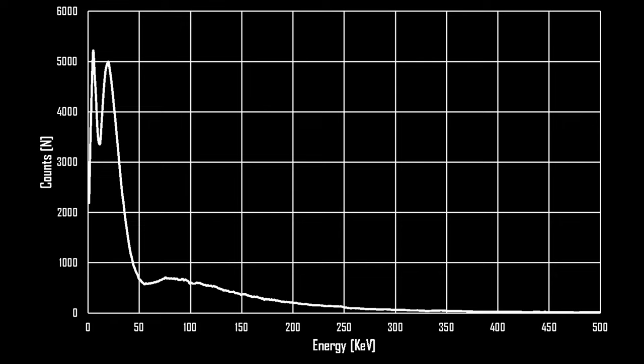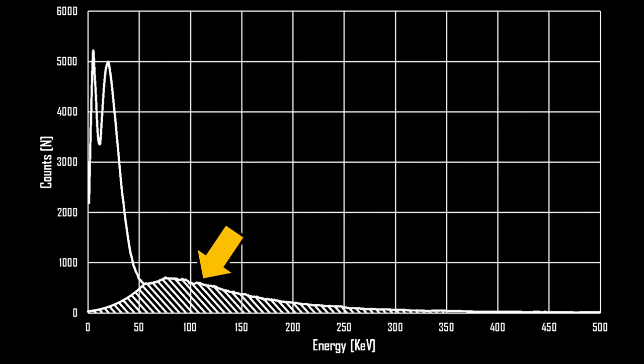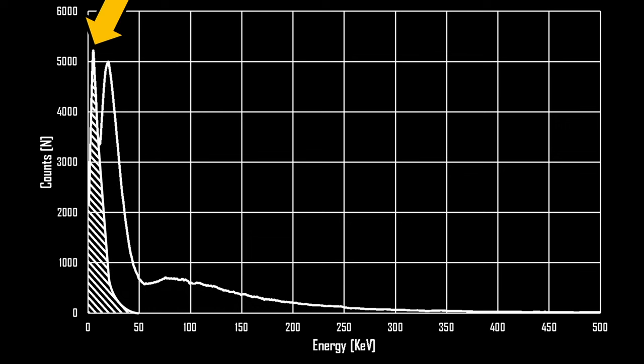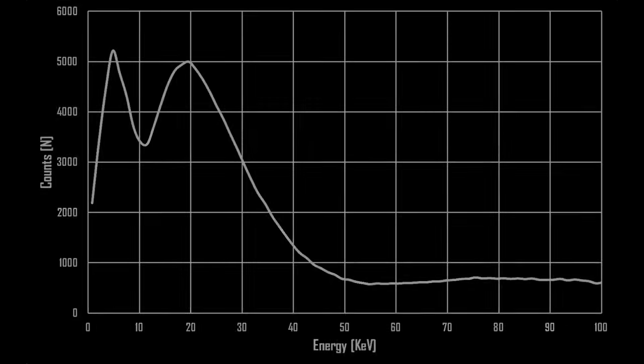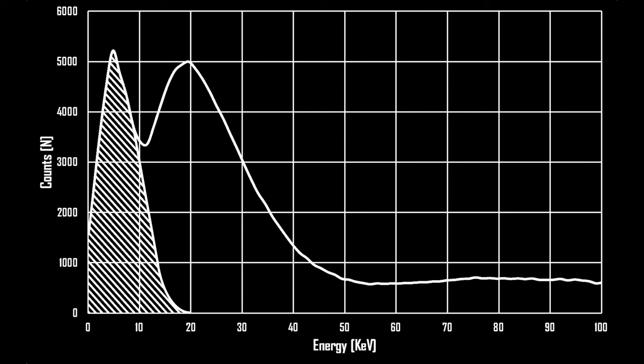Looking at the spectrum that I captured, there are three main spectral features. This peak is the natural background radiation, and I have a good idea what this one might be. The lowest peak is the main Bremsstrahlung x-ray radiation emission. Zooming in at the lower two peaks, if I extrapolate the main x-ray emission, it looks like the tube was operating at 20 kV. It seems like that shitty power supply had a brain fart — it delivered an excessive voltage to the tube, which probably arced over.